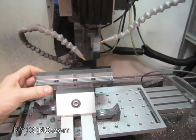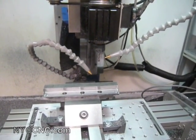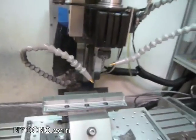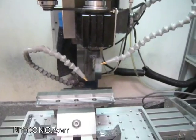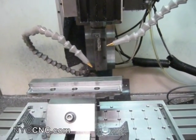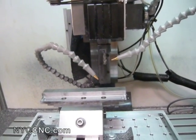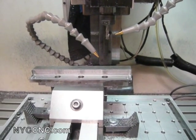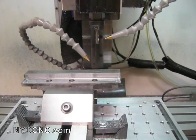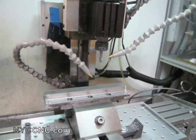What I wanted to show you was an interesting thing I learned: when cutting 4140 on my Taig, when profiling or pocketing, it actually seems to like taking almost a full pass or step-over with the bit. In my CAD software, the default is normally 50% step-over — for a quarter-inch end mill, that's 0.125 inches. But that puts a lot of stress on the mill, which you can hear as chatter and jerkiness. Doing about 70–80% step-over runs much smoother, quieter, with less vibration, likely because it keeps three or four flutes engaged.